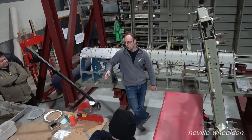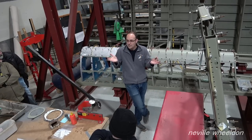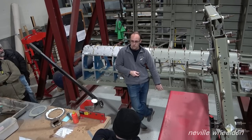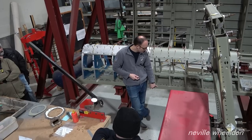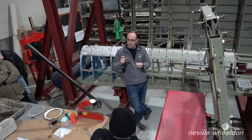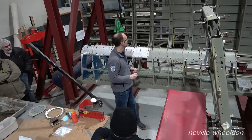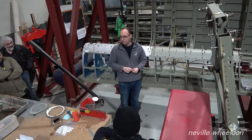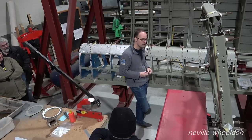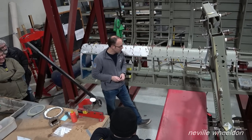When you put a new plug rivet in, the original manual says that every seventh or fourteenth rivet you produce a sample alongside it. You put the rivet in, then put an identical one in a piece of material beside it. An inspector would come along, inspect that rivet, dissect it, and make sure it formed correctly in the thread — because you can't see inside the material that it's been done correctly. They must be important enough that they have to be verified. You also have to measure the depth of the hole and work out the thread depth to know the correct length of rivet to put in, so you have the right amount of material reacting to the inside of the thread.